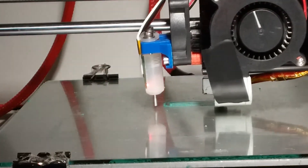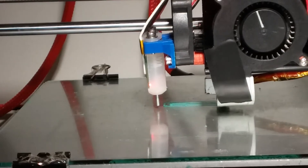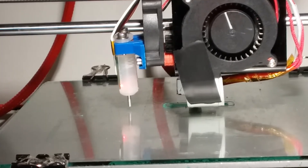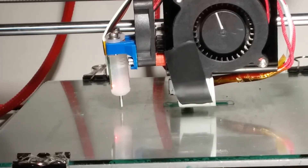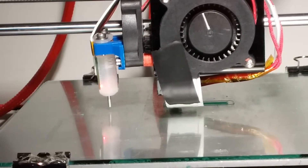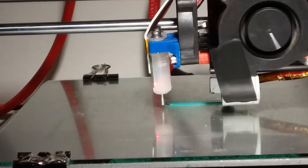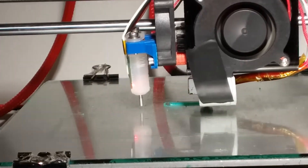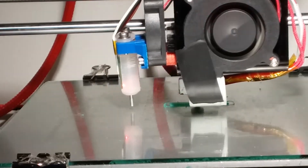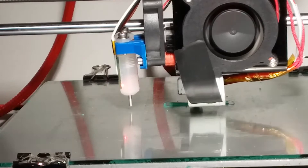This is printing with the settings at 156 millimeters per second squared, so this is going to be really slow. You can see it's very sluggish — the acceleration is set really low and it takes a while to get up to 50 millimeters per second. In that tiny little space, it never will reach 50 millimeters per second. The drawback is longer print times, but you get less ghosting.